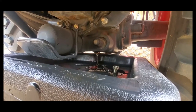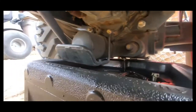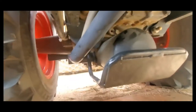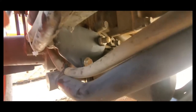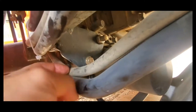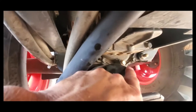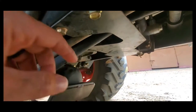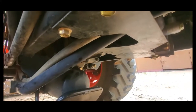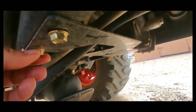It needs to do a bunch more work coming up soon. Now that the fluid is drained we're going to take the guard off the hydraulic filter. The guard has two bolts — one is through-bolted so you need a wrench for the back as well; the other goes into the casing so you only need one wrench. To get to the hydrostatic filter you also remove the guard right here, which has four bolts. Most of the hardware on this tractor is 12 millimeter, so make sure you use a 12 millimeter wrench — if you try a 13 you'll strip these.